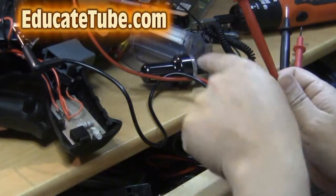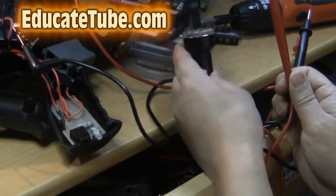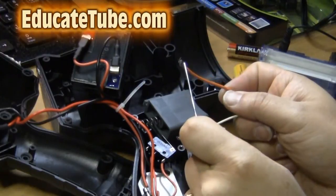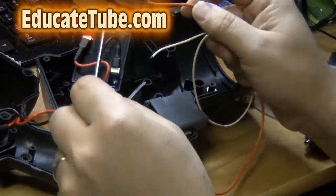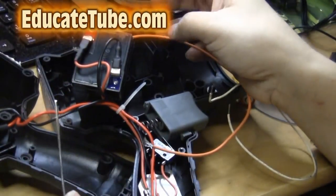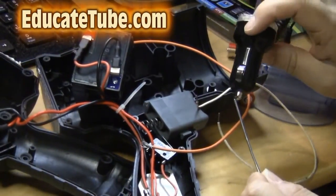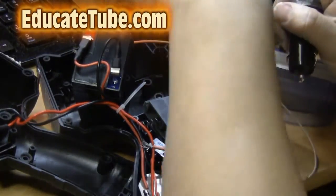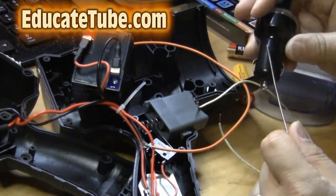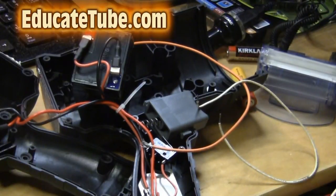Now I'm going to rewire it so that I can install the USB charger into this spotlight. You will need two wires — one for positive and one for negative. I'm going to solder the positive and negative onto the USB charger, and then drill a hole on the spotlight where the charger can fit snugly. Let's solder in the wire.